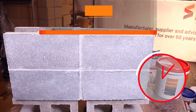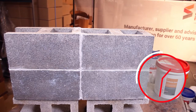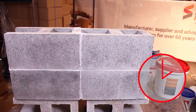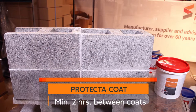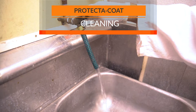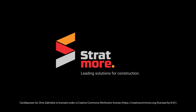As it dries, the white emulsion will become clear. Excessive foam, applying too thick a coat, and poor drying conditions will cause the coating to remain white instead of going clear when fully dry. Allow a good amount of time between coats — at least two hours. Clean up using water before any skin occurs on the equipment used.